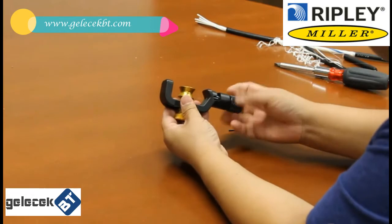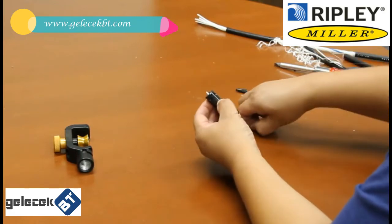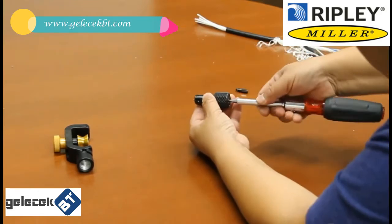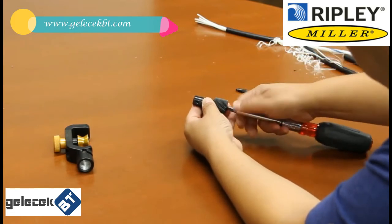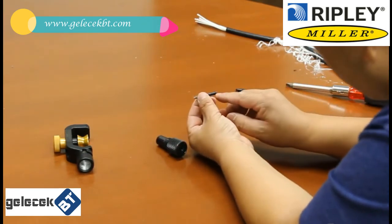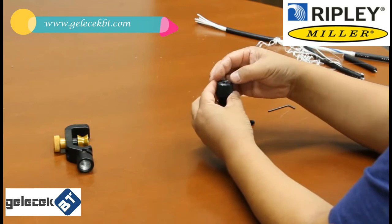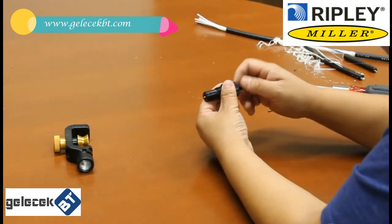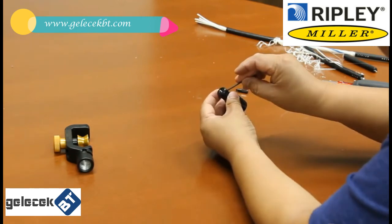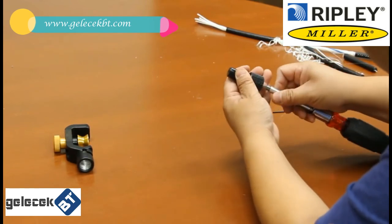First, remove the thumb screw, then completely screw off the bottom assembly. Here is the blade. Here is a set screw which prevents the blade from rotating inside the holder — let's loosen this screw first. Then we can use a screwdriver to fully retrieve the blade. Here is the blade assembly; it has a lock washer in place — don't lose this washer. Once you replace it with the new blade, just put it back in and screw on the bottom screw. Then rotate the blade to the correct position and tighten the set screw again. Try raising or lowering the height of the blade to make sure the assembly has been done correctly, then put the whole assembly back together.